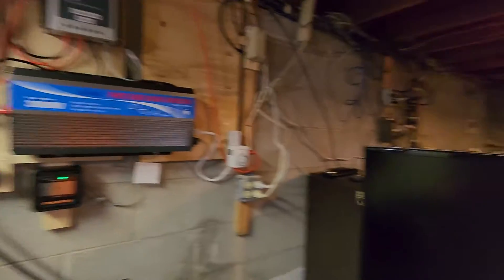This happened with the default settings for lithium iron phosphate batteries and with many other settings. So I gradually turned down the voltage in incremental steps until I could get it just low enough so that the alarm would not go off. I tried turning it way down but then my panels were not outputting their full capacity. The charge controllers weren't able to efficiently charge the batteries.